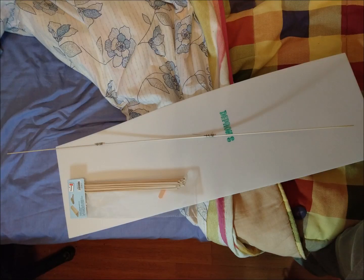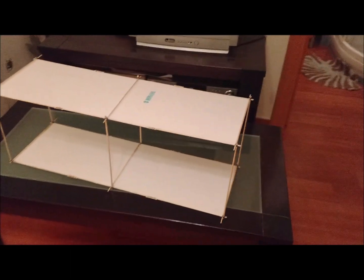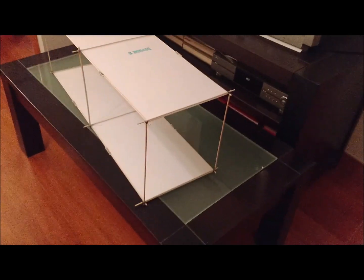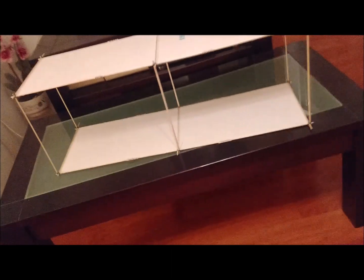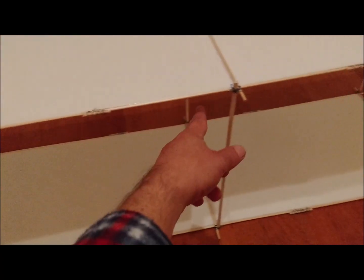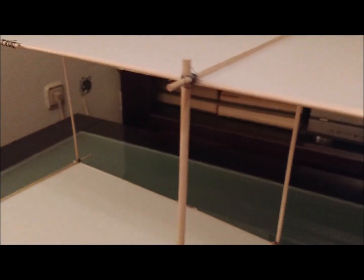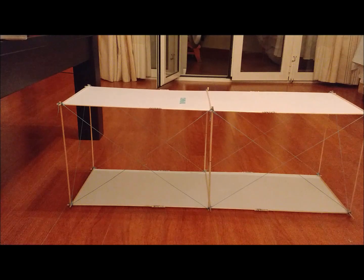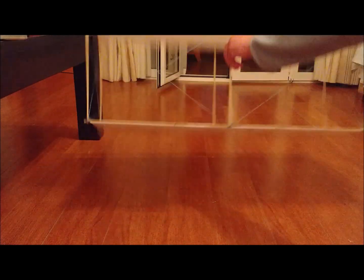In the following video, we are going to build a slow flyer biplane for indoor. We have used depron sheets with a thickness of 3mm as the main material. Each sheet is 80cm long and 25cm wide, and has a weight of 22g. We build the two-wing structure with a vertical offset of 29.5cm. We use wooden sticks of 3mm in diameter to reinforce the perimeter of the wings, sticks of 4mm in diameter to build the corner struts, and sticks of 5mm in diameter to build the two central struts. All joints between sticks are made with sewing thread and cyanoacrylate glue. A triangular structure is created, wiring the diagonals with thread so that the rectangular faces of the parallelepiped do not deform. This led us to achieve rigidity using a minimum quantity of material.